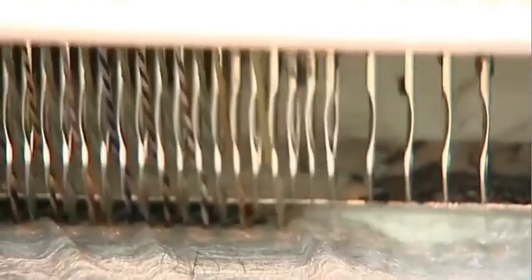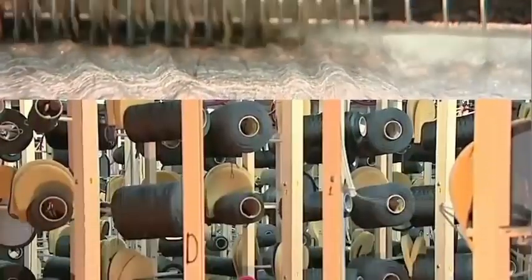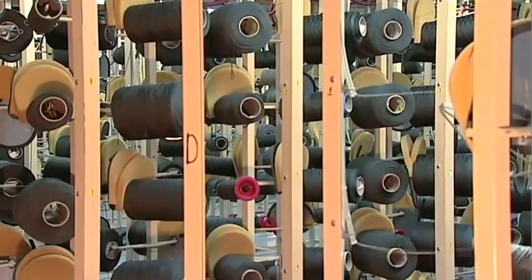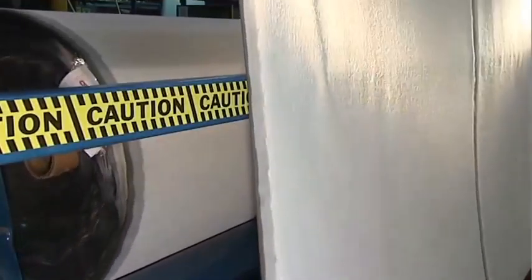Typically, the 1/4 gauge would tuft at a slightly higher pile height to provide the dominant pattern, with the 1/8 gauge supplying the background coloration. A second option is the double 6 machine, with two 6 gauge needle bars fed from creels. Both needle bars have full repeat capability, allowing tremendous flexibility in pattern and texture. Next on our tour are post-dyeing operations for tufted gray goods.